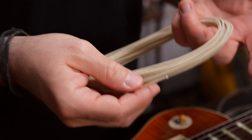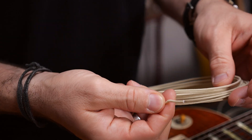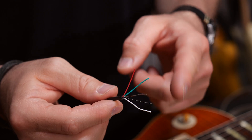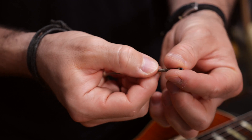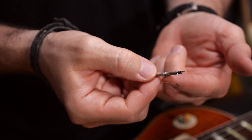There are different wire types. Old school unshielded single wire — you'll find these in Fender style instruments. There are also shielded wires, four conductor wires, etc. This is a braided wire, and you'll find these mainly in Gibson guitars and basses. The core wire is hot, and the braided shielding is ground.